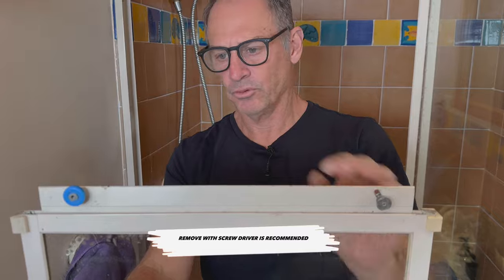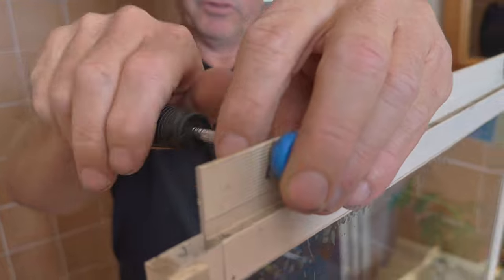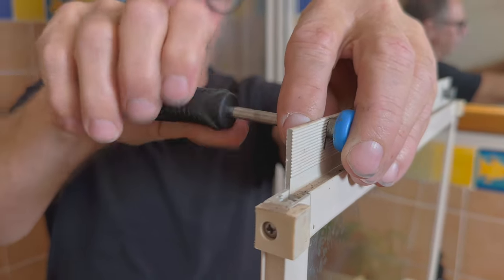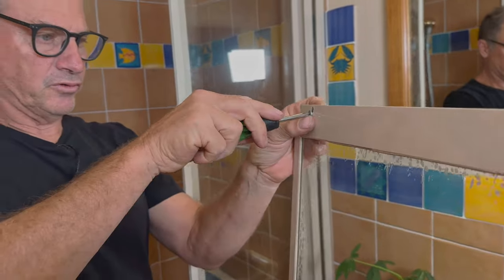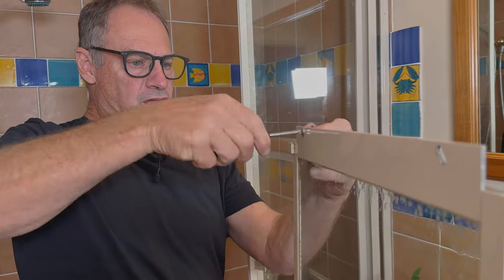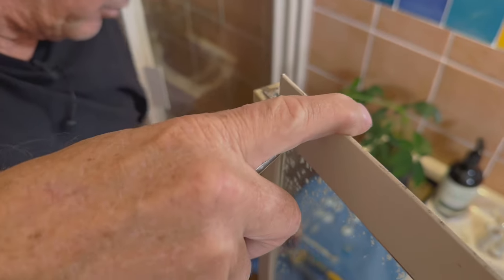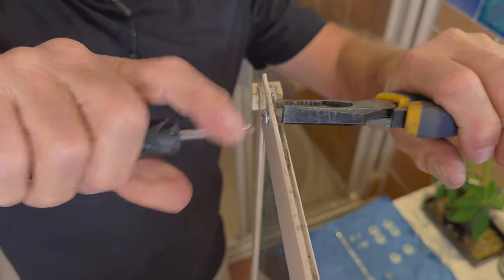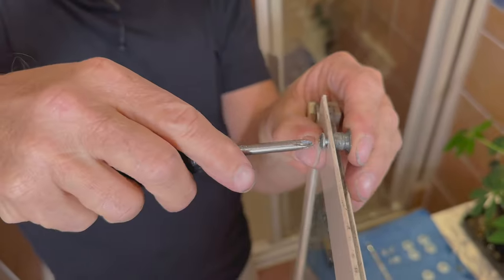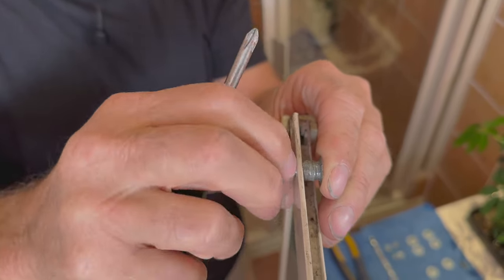Lift it up — watch the roof — or twist them around. Grab the door, finger over the roller, into the screw hole and just hand-untighten them. You can do it with a drill or a power screwdriver, but I like doing it this way purely because you've got a bit more control. This screw is actually really, really tight on that roller, so what I do is get a pair of pliers, just crack it. I've cracked the seal. Wind him out and out he pops.